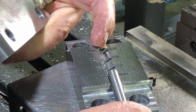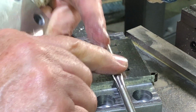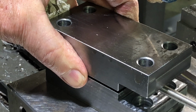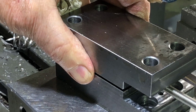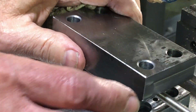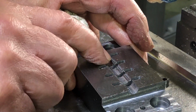All right. There's two dies, there's a 3/16 ferrule. The cable comes in this end. That sits in there like that, can't go any farther up. The cable slides all the way up into the ferrule, and then the crimp occurs. And you can see that, if I had to guess, there's probably an eighth of an inch in between those two blocks. So when they come down, they close up under that ferrule. And where it crimps, what comes out the sides should expand into these little relief slots.